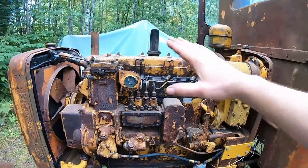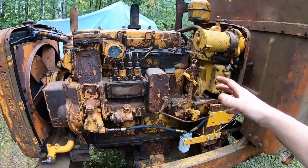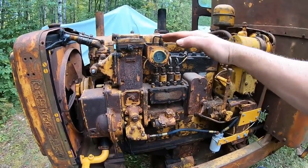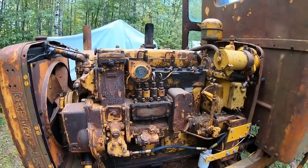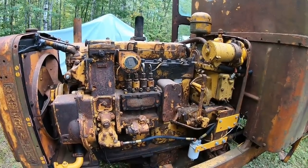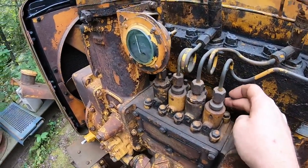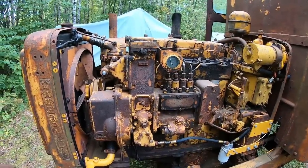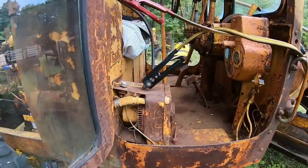And we've got the hood off. As you can see, hood is sitting right there. The reason for that is we found with this engine, if it sits for a while, it must have a tiny little fuel leak somewhere, because it bleeds back. So it always gets some air pockets in it, and then it's a difficult first start when we try and crank it after it's been sitting for a while. And of course, this has been 2 years on this one. So we just pulled the hood right off. We'll get the starting engine cranking the diesel, and I'll go back here and we'll open these pump bleeders and probably crack the lines of the injectors. Once it looks like we've got good fuel coming, then we'll see if it's going to actually take off and run. In the meantime, we need to make sure we have some brakes.